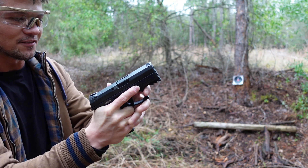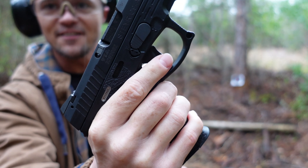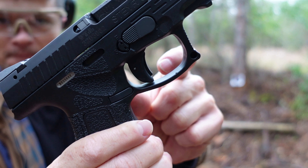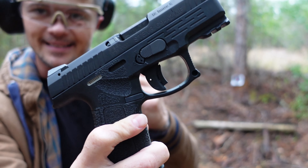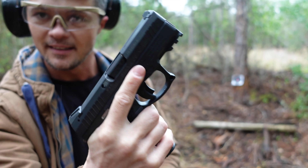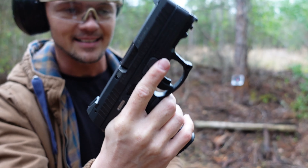The trigger has a very similar system to the Glock — a safe action system which gives you a drop safety. But here it's actually a little bit cooler than anything else I've seen. If the gun is not cocked, the safe action trigger sits almost flush to the trigger. Once you cock it, it sticks out — so it works as an indication device telling you the gun is in a ready firing position. Just by looking at the gun you can tell it's cocked. It doesn't tell you if there's a round in the chamber, but still it is a huge plus.